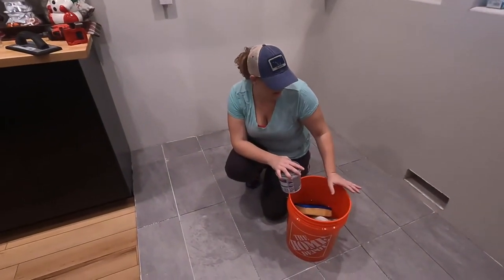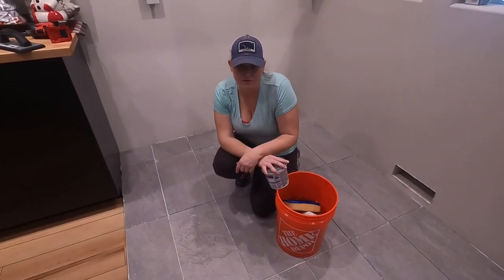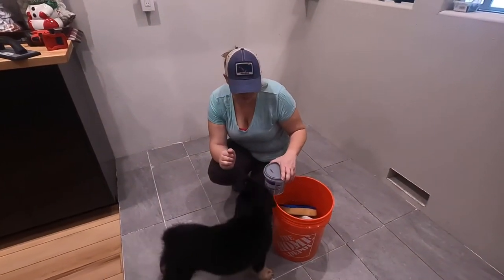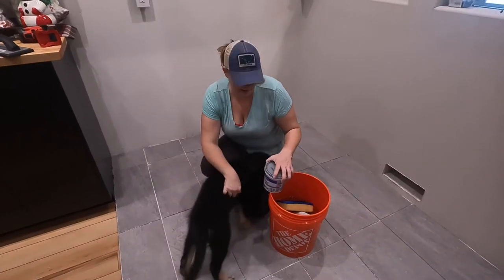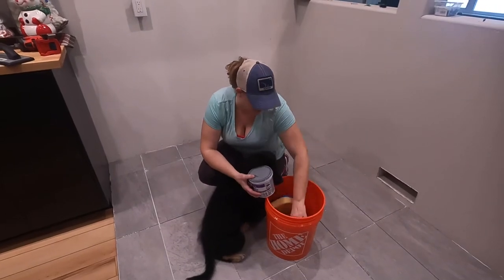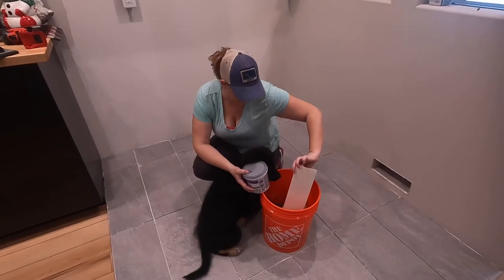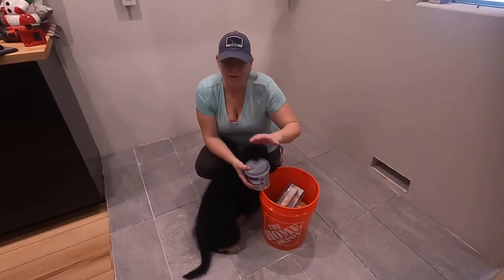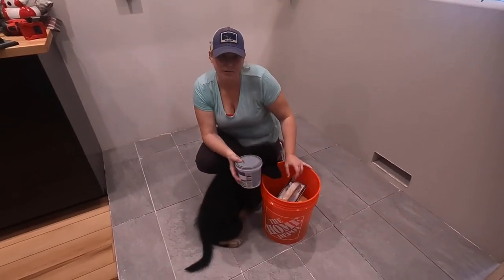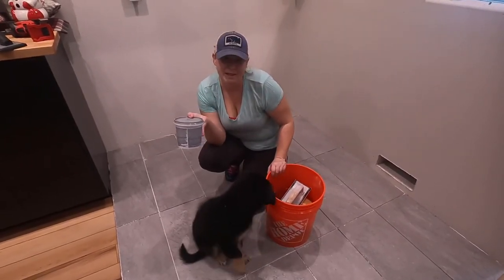We have the tile done and we spent about 24 hours waiting. The mastic that we used says 24 to 72 hours is how long it's going to have to wait for grouting. We have a new puppy — say hi! I used a pre-mixed grout. I use the sponge and I have two grout floats — a super soft one and a firmer one. I already cleaned out the grout lines and vacuumed everything, and I'm going to scrub each tile as I go along, pushing the grout in and then washing as we go.